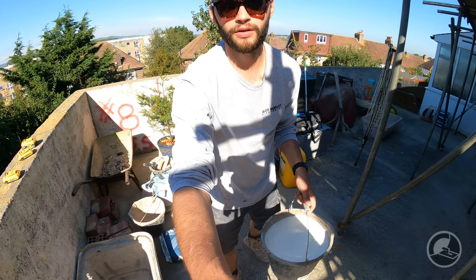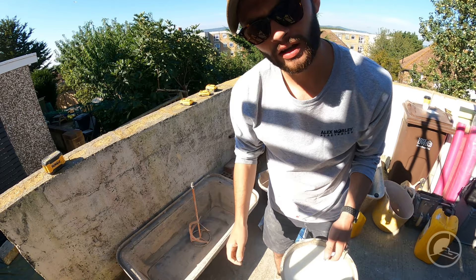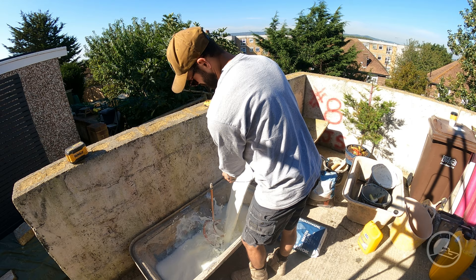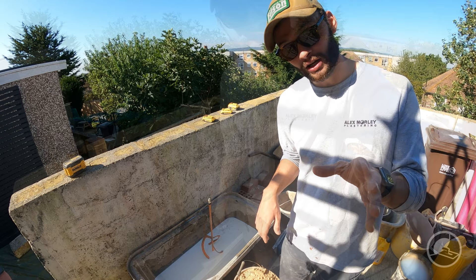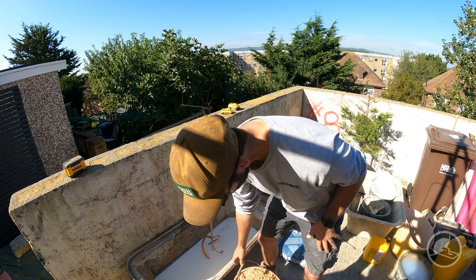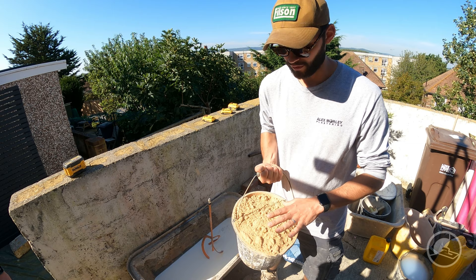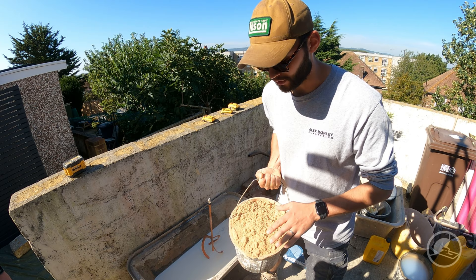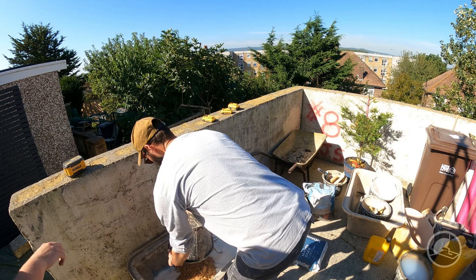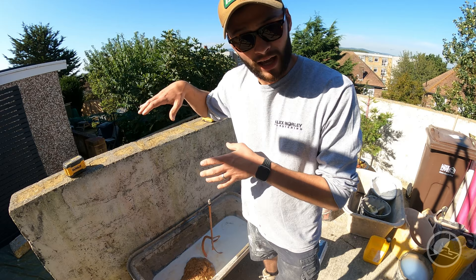Because we're doing a double gauge, we're going to put two buckets of water into the bath before we add any sand. When it comes to the sand, it's four sand on the scratch coat, always gauged in black buckets pretty much level to the top. If you do it level, you know it's going to be the same every single time. We put four of these straight into the water before any cement — that's half the gauge straight away.